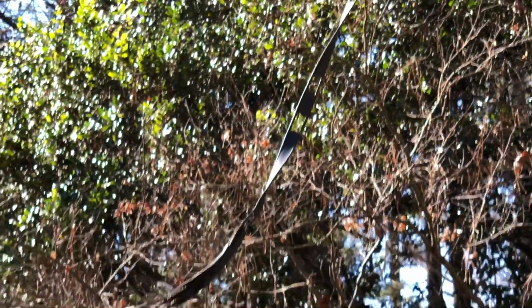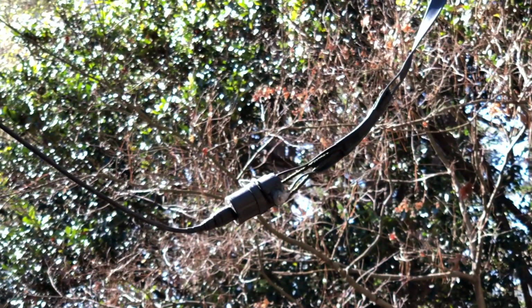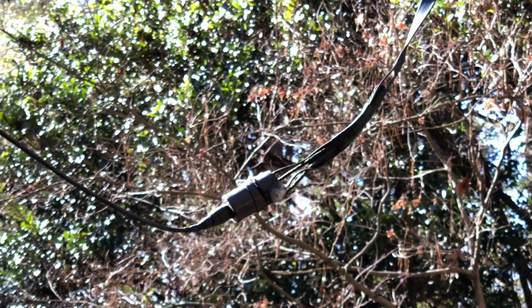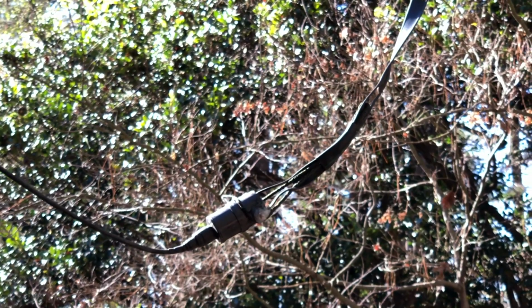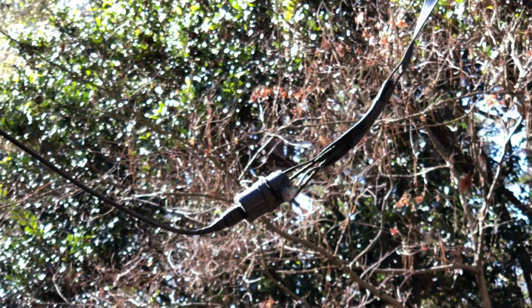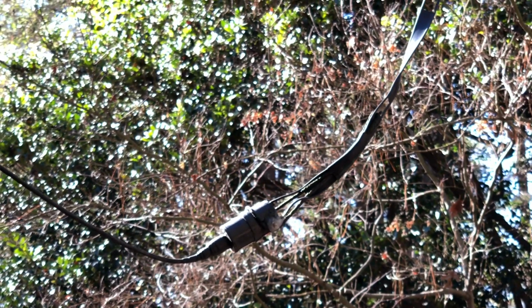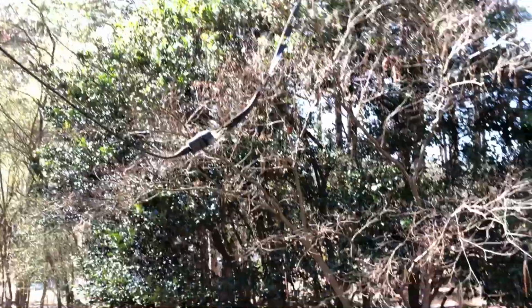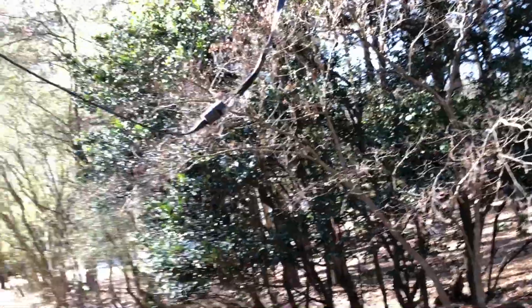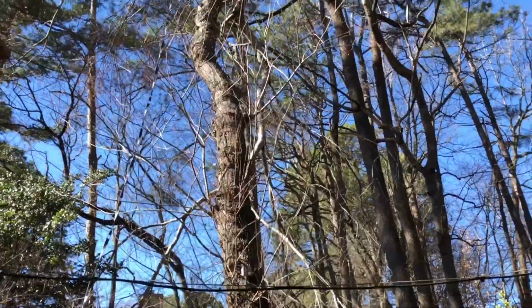It comes down, there's the ladder line feed that comes down where you hook your coax, and I'm using RG8X. One of these days I'm going to replace that coax, but it's been here since 1998, and it's RG8X, so not terrible for HF, but I will be replacing it with LMR 400 when I do replace it. Let me back off a little bit so you can see the center point of that ZS6BKW a little better.